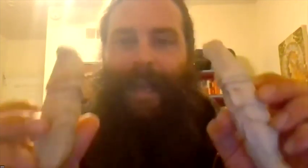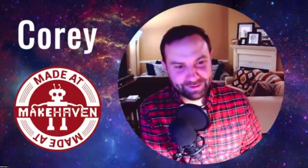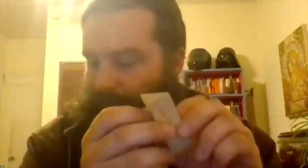But I mentioned last week that I've been hand carving these little wizard men. And the wood that I'm carving that out of is just square like this. And you really need only a little triangle because the face is out of just this corner. So I made this very silly jig by setting the table saw at 45 degree angles and then cutting a little slice down the middle so that I could put one of these in the bandsaw and cut it in half down the middle, which I thought was pretty cool.